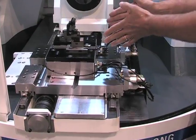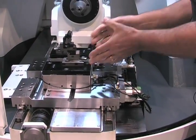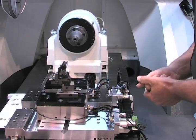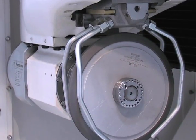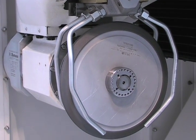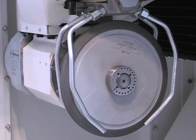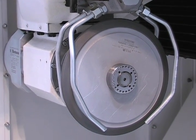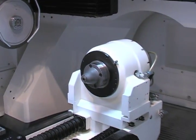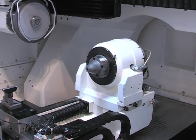We can move the X-axis out of the machine so we are very close for the setup. It's a very easy setup with fine adjustment screws. We have a new spindle with 47 horsepower and HSK 50 taper. The RPM of our rotary axis, the A-axis, is 1100 RPM.